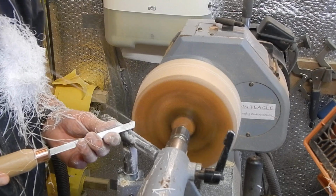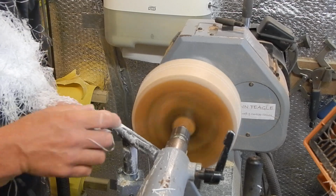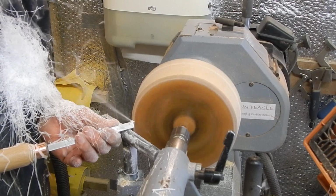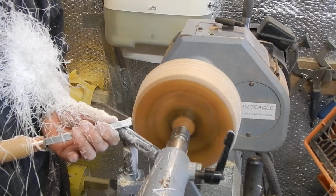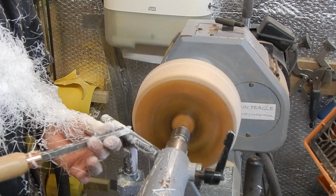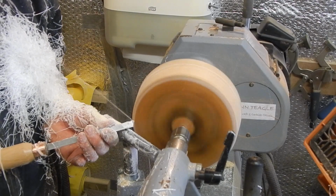Now you can see how I can come round. I can come round that corner because I'm staying on the tip of the cutter all the time. See, on this side's not going to come in contact. So I'm on the tip of the cutter. But I'm staying with my tool twisted, I'm not flat. I very rarely use my carbide chisels flat, especially the round one.